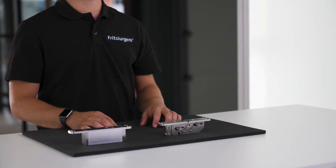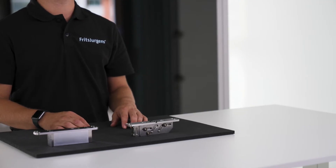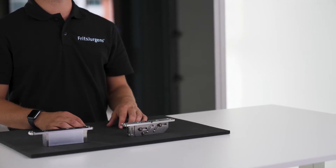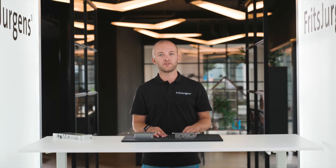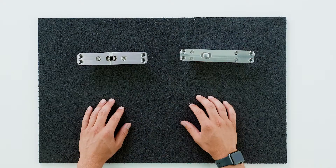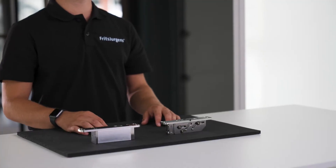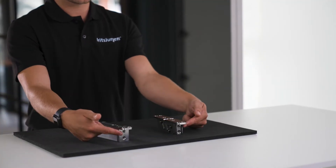These top pivots are mounted inside the top of the door — this is the top pivot point. After mounting, the whole system is mostly invisible; only a small ceiling plate is visible. This guides the spindle of the top pivot into the ceiling. We turn the spindle upward when installing the door, which keeps the door in place together with the axis of the pivot hinge at the bottom. After installation we have freedom to slightly adjust the door's placement using adjustment screws to move it perfectly straight.